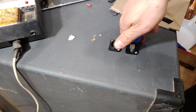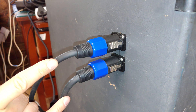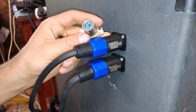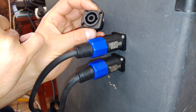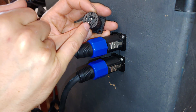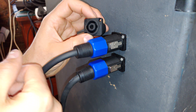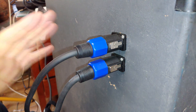There is the complete job using the Speakon. Some notes: one reason the XLR is not as good as the Speakon is that XLR can only handle 1.6 millimeter gauge wire. For subs like this — 800 watts RMS — you want a thicker wire. XLR can only handle about 15 amps, whereas the Speakon can handle about 25 amps per terminal. You can also wire one Speakon to feed two speakers — one-plus one-minus for one sub and two-plus two-minus for another sub, using one Speakon connector. Some amps accept bridge mode on one channel, or you can feed both subs via one connector. In this case I already had two holes and was happy with that option, so I left it as is.